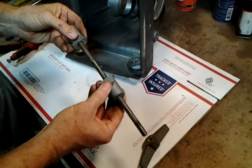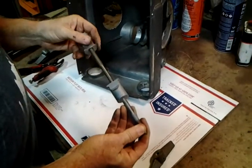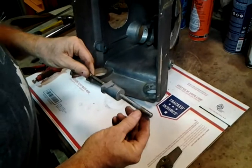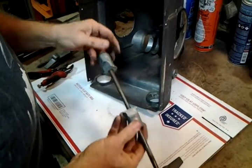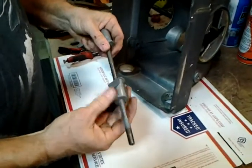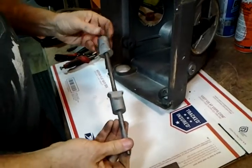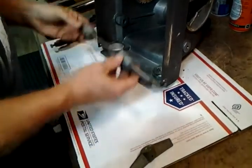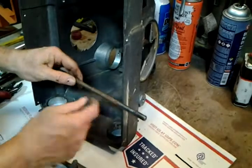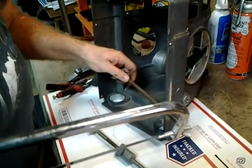You have to have both wedges able to move. I see a lot of machines that have that problem where the metal is torn off and messes up the threads. Sometimes you can clean threads up with a wire brush, but sometimes it's just too impacted or too distorted. The wedges you're not really going to save unless you want to do some tap and die work — they're inexpensive enough that you can just buy replacement wedges, the rod, or the whole works from ShopSmith. If things are jammed up too bad, I've just had to saw the rod right in half to be able to get them both out.